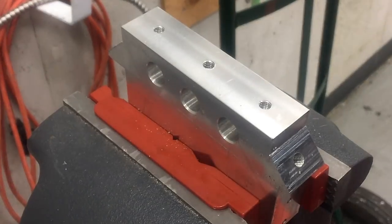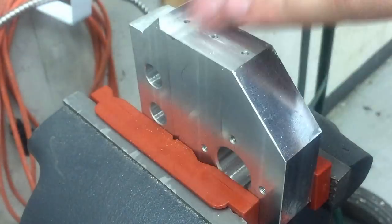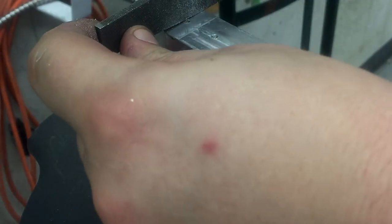One part of machining I've really come to enjoy is filing. If you remember that a file is actually a cutting tool, and you have good posture, take your time, plan each stroke, you can actually get some really amazing surface finishes. I can get fairly consistent chamfers now by filing, and like I said, I actually kind of enjoy it.